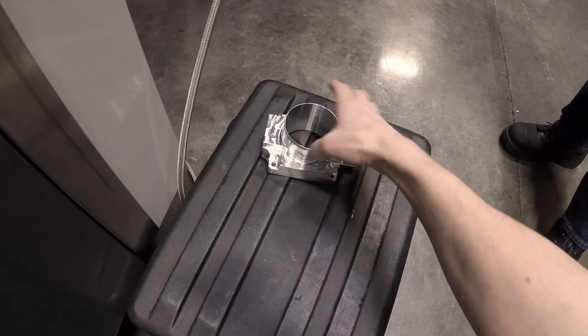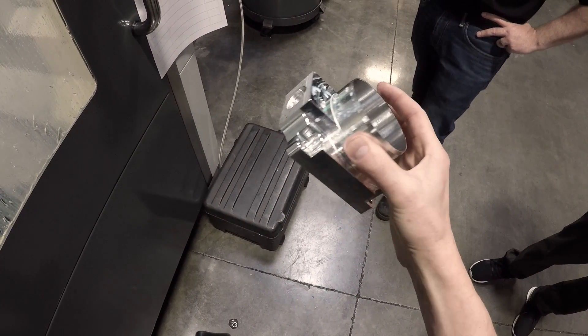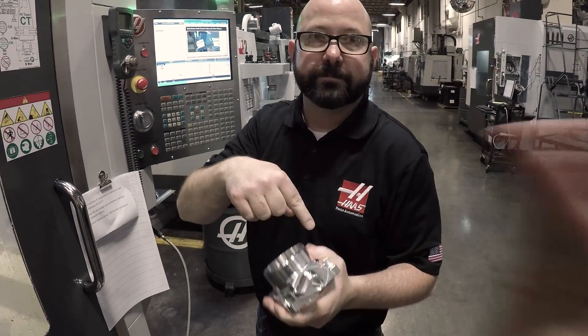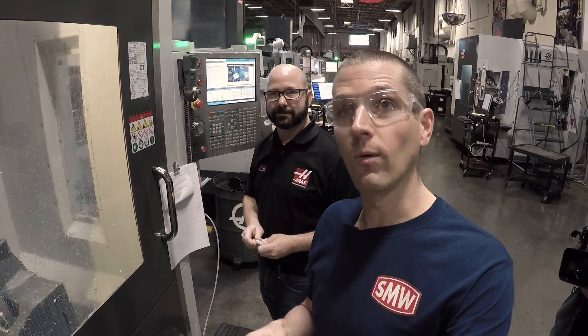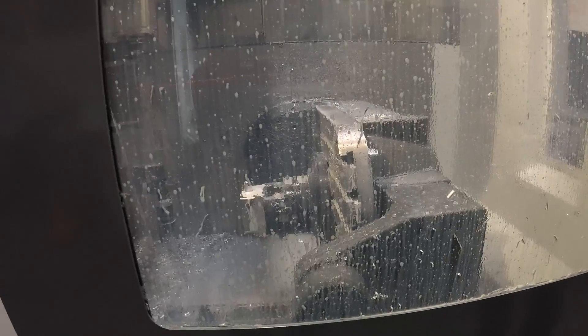The part we're making has a good amount of material removal and positional work. Is this going to be done on a true fifth axis running around that chamfer? What's funny is this chamfer on the top and these angles on the drafted wall are all done simultaneous five-axis. I cheated — I didn't have the right angle tool, so I used a swarf strategy, cutting on the side of the tool rather than the tip — just a regular half-inch end mill. I come down and walk around it, roughing a little bit away, finishing the floor. In a second you'll see some small five-axis moves for just a two-degree draft. If you like five-axis stuff, click the card — when I was in Sacramento with Tim Paul we filmed a demo at Selway on a UMC 750. You can see the angle there, just rolled up and over, chamfering all sides.